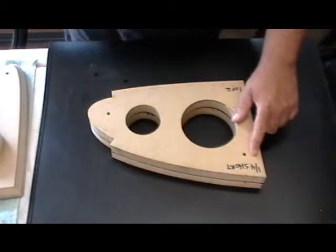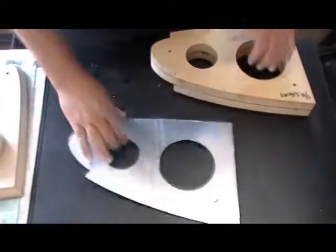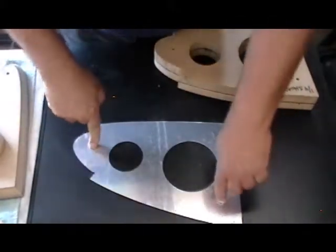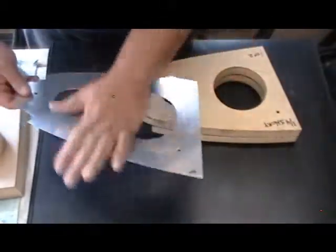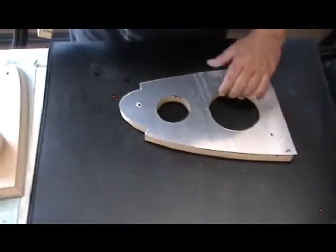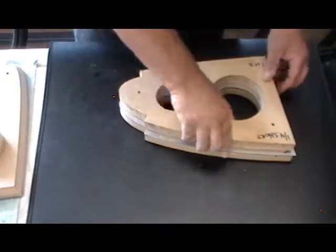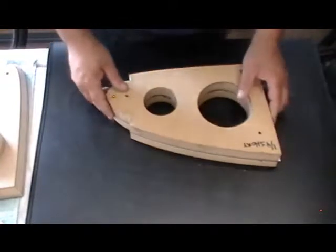I have one for one-eighth in full size. What happens next is — remember that aluminum blank we cut out, roughly this size with these two tooling holes in it? Without any other holes or shapes cut in, it gets sandwiched along with five others — because they all have the same tooling holes — in a stack, sandwiched between these two blocks, and then pinned with the pins.